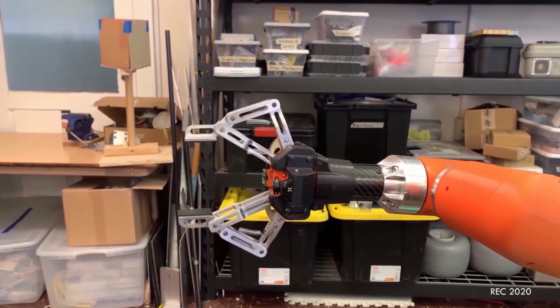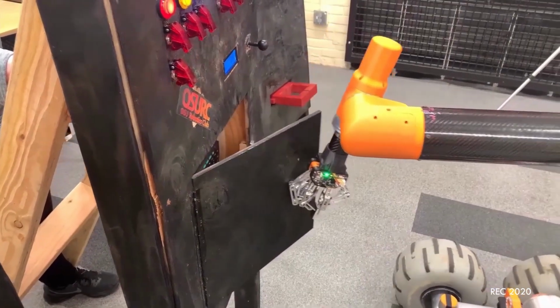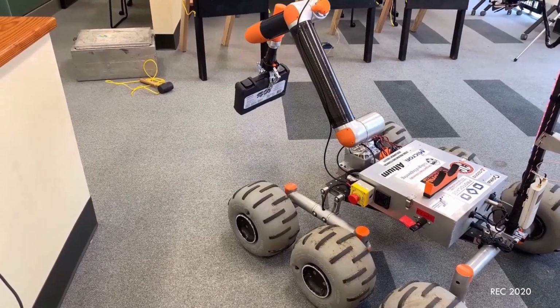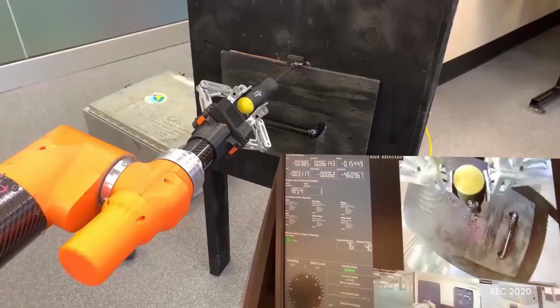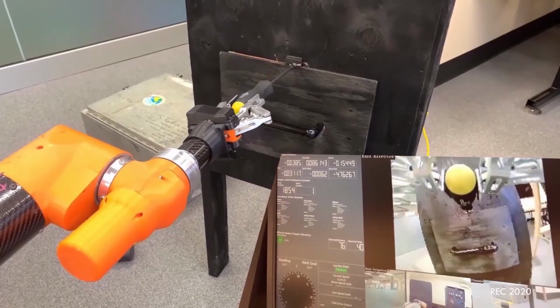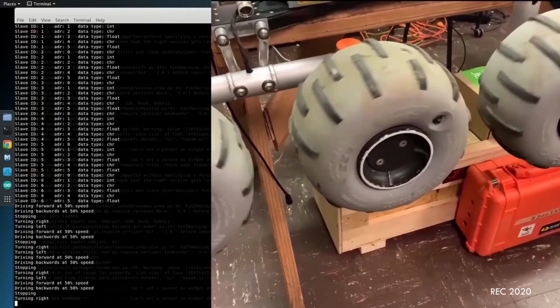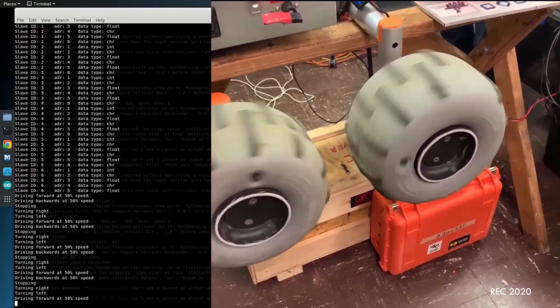Our arm has encoders and strain wave gearboxes at each joint to provide accurate positional feedback and reduce backlash. A camera, distance sensor, laser, and force sensor integrated into the gripper relay situational data back to the base station. The gripper and the arm will be controlled as part of a larger RS-485 communication network, running a custom, reliable signal protocol based on Modbus.